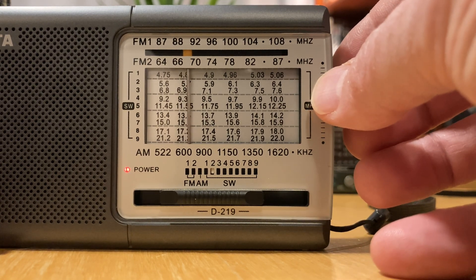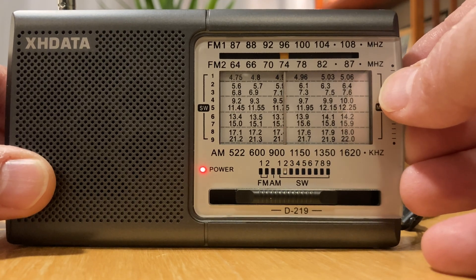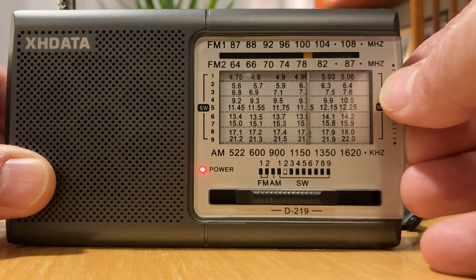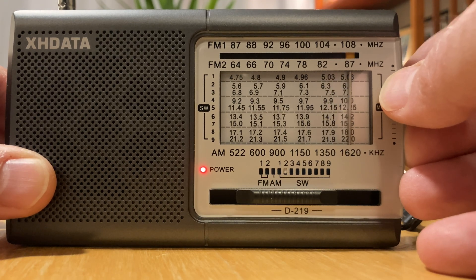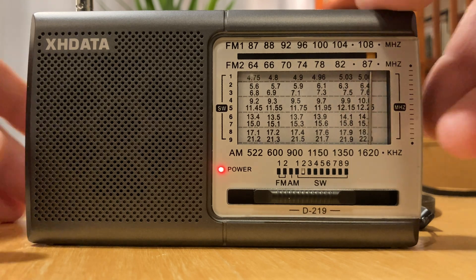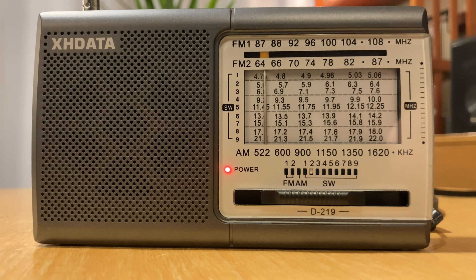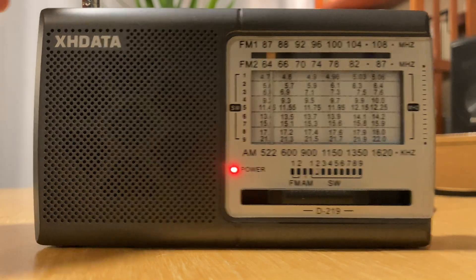I'm just going to go very quickly, because what I'm trying to show should be apparent already — it's tremendously overloaded. And remind you, there's no external antenna, but the area is overloading. That band is full at this time of night. We've got Cuba, we've got the anti-Castro Cuban stuff from the US, we've got Radio Japan rebroadcast from France that ought to be on there — it should be pretty busy. But we're getting nothing. So it's overloading.